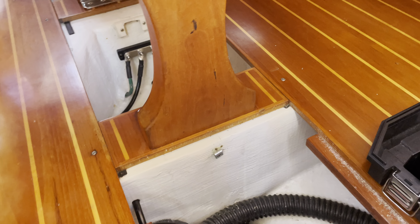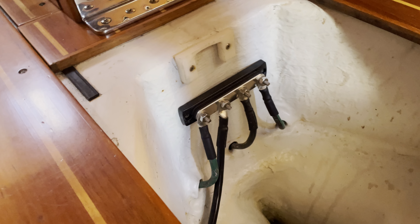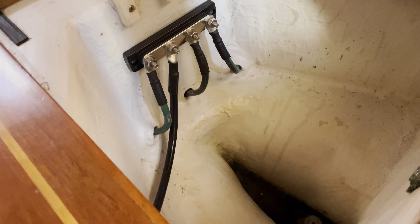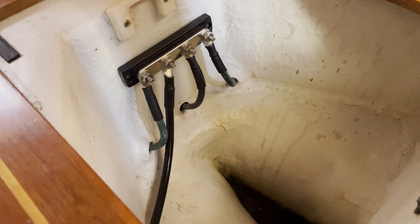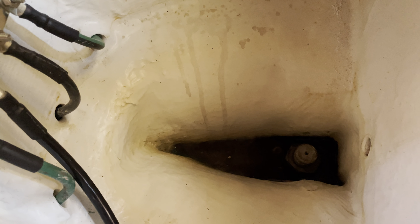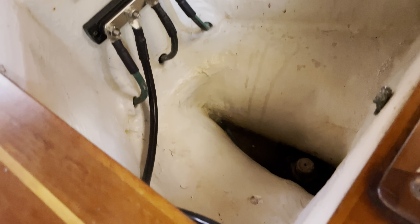What am I doing? I am reconstituting our bonding system. What I had before were a bunch of wires coming through the scupper holes, which I don't like because it restricts the flow of the scuppers. But it's how J Boats did it — it went down into the bilge, the forward part of the bilge, to that keel bolt and bolted onto the washer. Honestly, I don't know if it has a good connection because it's got a bunch of 5200 around the washer and the bolt.